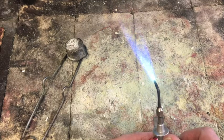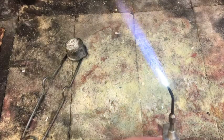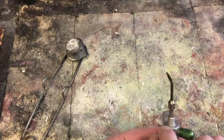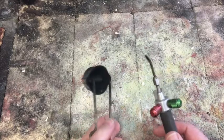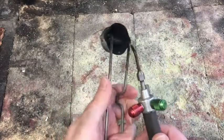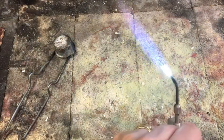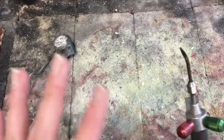What we're looking for is where it just goes from that bright white and orange just to the blue, and then we stop. If we go too far with the oxygen, it'll blow the flame out. We want to go just past that white to get a nice blue cone. To turn off your torch, we turn off the gas first — which might make it pop, and that's okay — then turn off the oxygen. Righty tighty, lefty loosey. So: striker in left hand, quarter turn to the left, strike, then add oxygen until you have a nice blue cone. To turn it off: righty tighty gas, then oxygen. That blows the excess gas out of the tip. Practice that a few times before you actually start soldering, and make sure both are closed down so we don't waste gas.